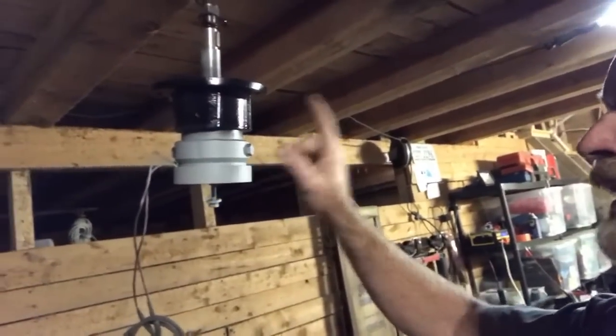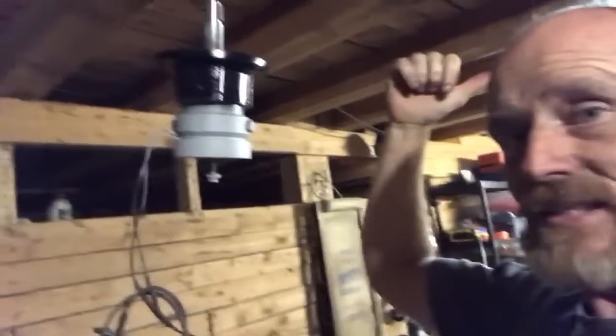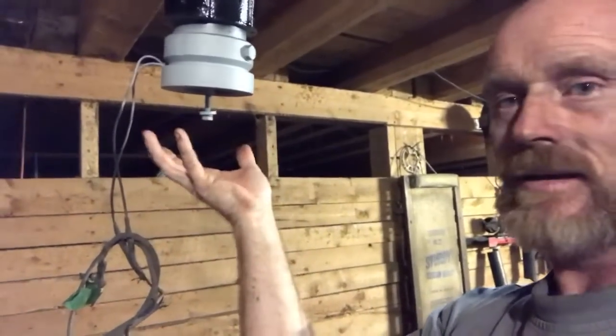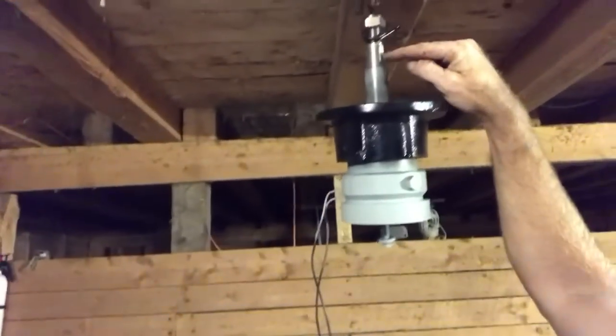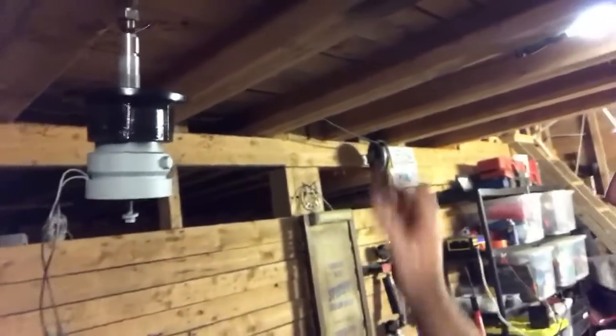Here's the electromagnetic clutch off the ballast. Basically, there are belts going around on the front on that pulley system, but they are not engaged with the pump. The belts are going around here and not turning the shaft up the centre. When you engage the electromagnet, it all clamps together and drives that shaft — you can see where this key is and that drives the pump. Here's the front of it with the clutch in it. They're getting a first coat of primer and will probably go into Yanmar Silver.